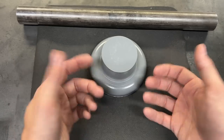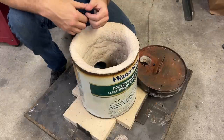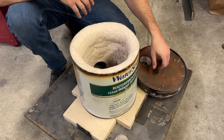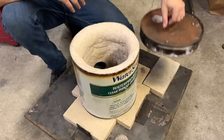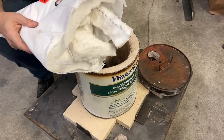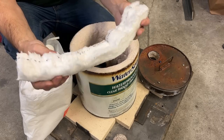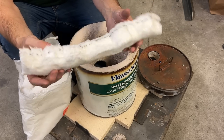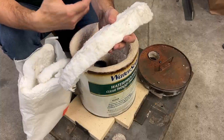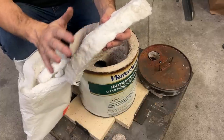I've been doing a lot of prep work to get ready for this. First things first is the kiln. You can make one of these from just about anything. Mine, for example, is made from an old Thompson's water seal can. I've just cut the top off so that I can easily take it on and off, and then the inside is lined with a couple of special materials. First layer is a ceramic insulation. This looks very similar to your normal pink insulation that you would put in your house, but this is made from ceramic instead of fiberglass, and it is fireproof. It also helps to insulate temperature, so temperature doesn't pass through it very well.